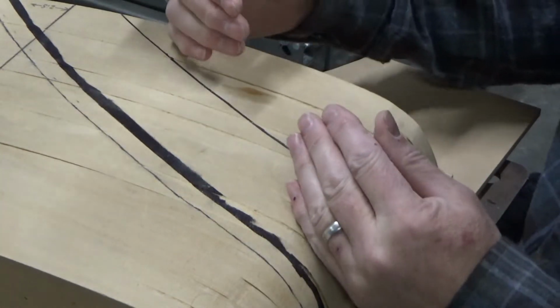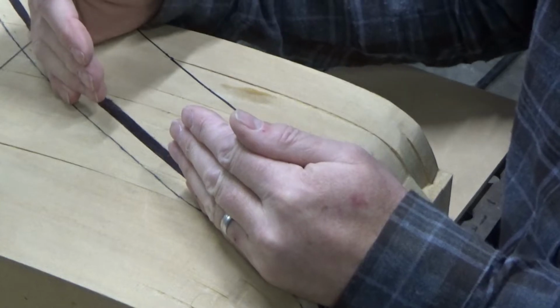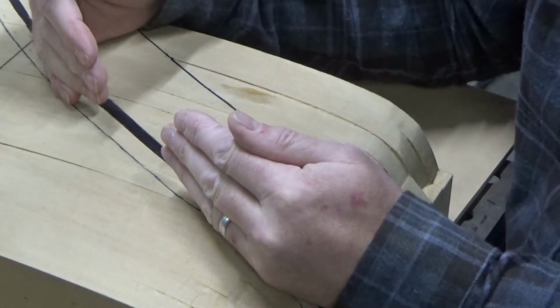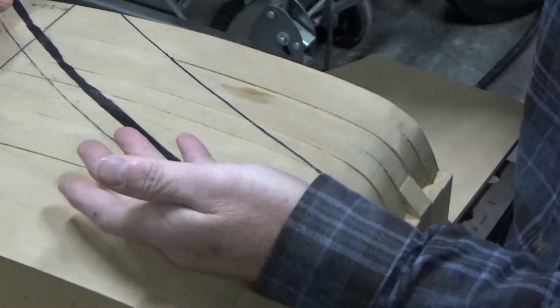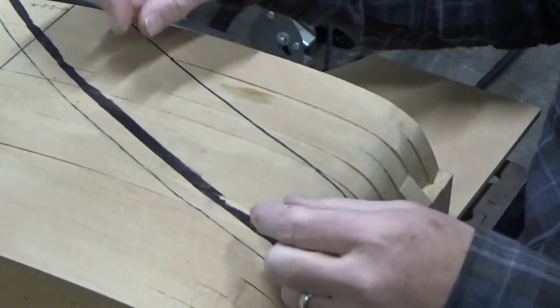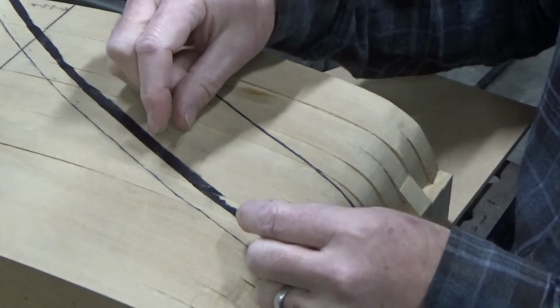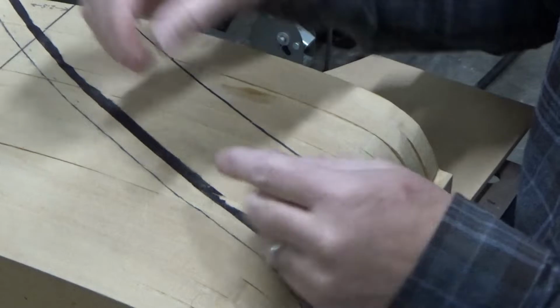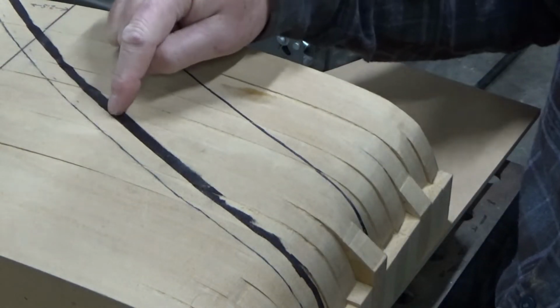And so that when I cut that out, I can reinforce the edge with a thickness of 120 wall steel that will create the actual edge that this patch panel is folded over. And then in addition to that, there's another 350 thousandths worth of an inch to create the bead that goes along that edge, and so that distance is what makes that up.